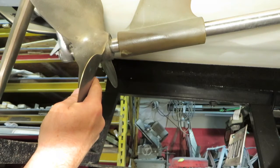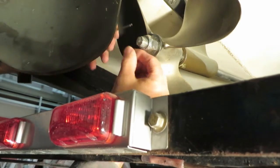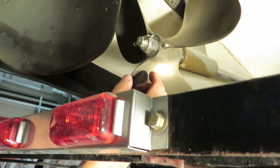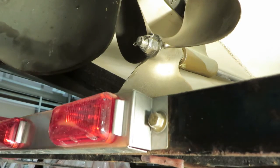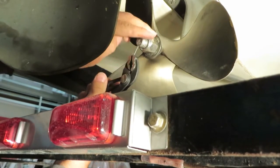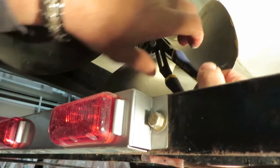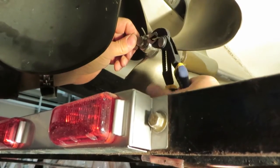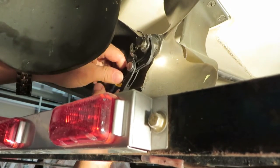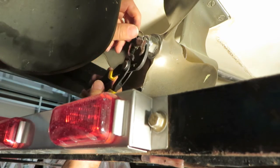Now it's just a matter of tightening up the nuts. The last thing we have to do is put a cotter pin or safety pin behind the lock nut. If your cotter pin has one ear already broken off, replace it and put a new one on. It's rare that you can use a cotter pin more than twice — three times you're really stretching it — so we try to put a new one in most of the time. Bend these tabs over all the way so you don't collect weeds when you're going down the lake. That will complete the propeller installation once we get this last tab folded over all the way.